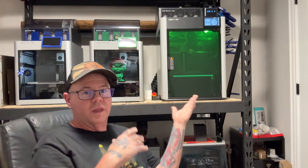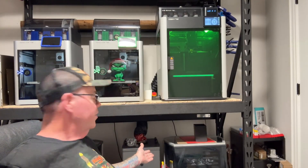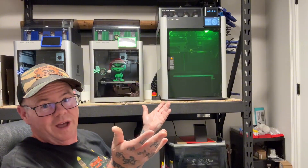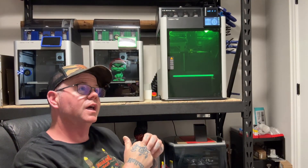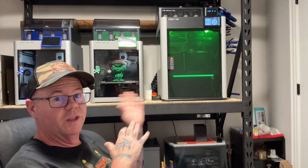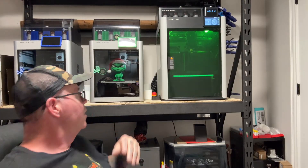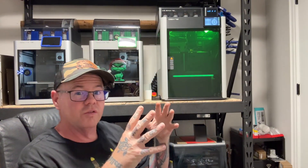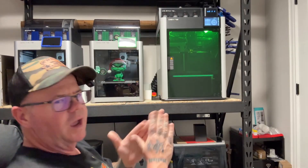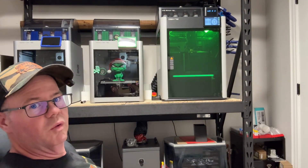So basically what I was talking about was the performance of the laser. Do I think it hurts the machine? I don't know - if you take care of it, I don't think so, as long as you have the proper equipment like the smoke eliminator which takes it right out. I'm going to unhook it in a few minutes because I'm going to be doing printing - it actually sucks too much air if you're printing ABS or anything, it just pulls the heat right out. It's an awesome feature and if I was going to have the laser I would definitely buy it. Links will be in the description. Regular maintenance is key - you're just going to have to clean a little more often if you're running the laser.